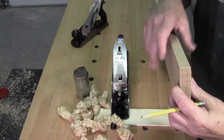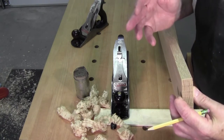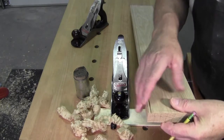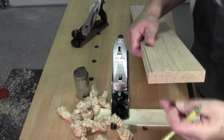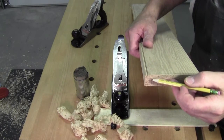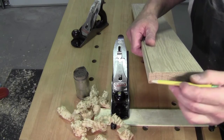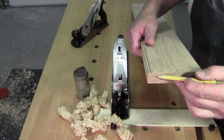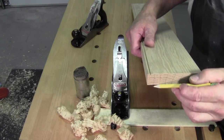Red oak, it's like a sponge. That's one of the reasons why they don't use red oak. Also the taste is different — you get more vanilla flavoring from white oak. But that's barrel making 101. You use quarter sawn staves and you use the liquid on the inside or the outside of the quarter sawn stave, and that way the liquid cannot penetrate past the medullary rays.